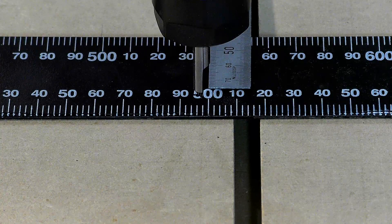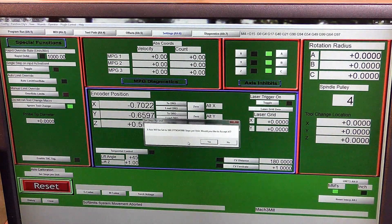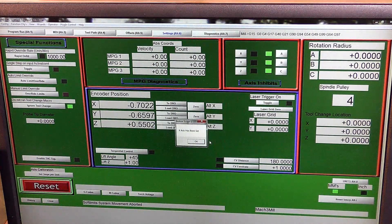In this window we are going to put 499, which is the reading we got, then press OK. Mach 3 is going to calculate that for the correct setting for this machine with these ball screws it is 1600. Incidentally, I have 800 steps per revolution set in the motor drivers, so that's why the number might seem a little odd. The result is 1600.577, and we say yes we want to alter it.